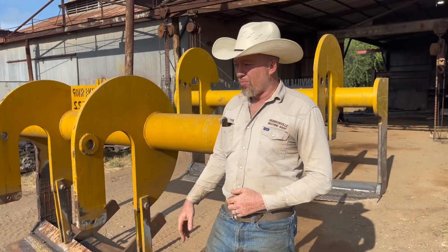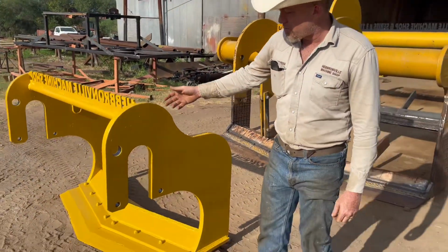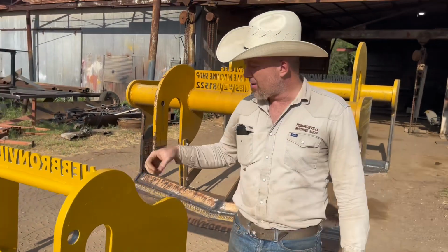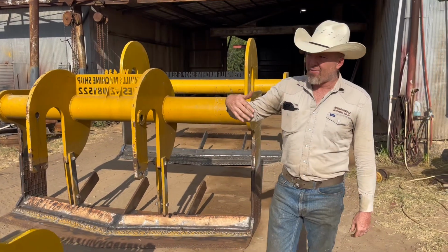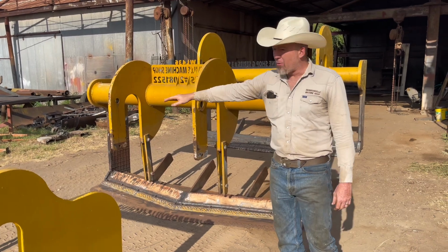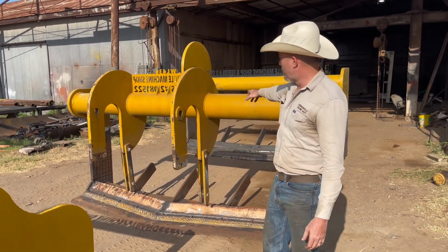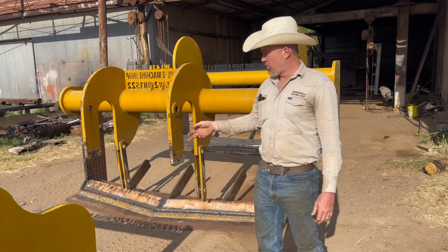And like I said, you got to have a plow for every situation. So we've got the little guys here for the little dozers, for the small time guy that's just starting out. And like I said, with these you can spot grub, pick an individual tree, pull it out, or you can root plow. All right. And you get into the bigger ones. If I had a John Deere 750 here, that plow would be in between these, and that would fit like a D6N and a 750. The D6N, they're smaller, like the 150 horsepower, and it probably wouldn't pull this. Now a D6T would pull this easily, but the D6N wouldn't.